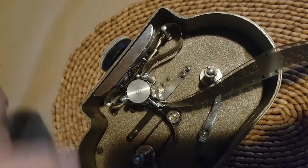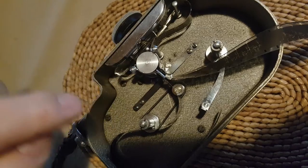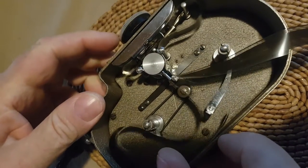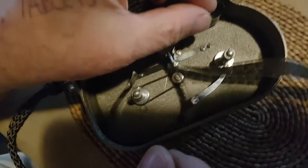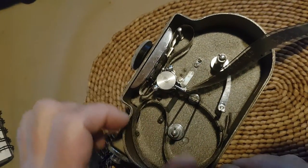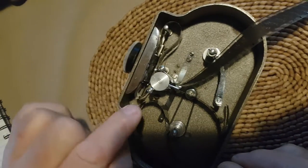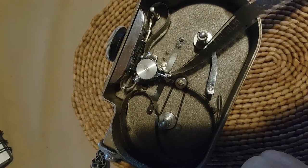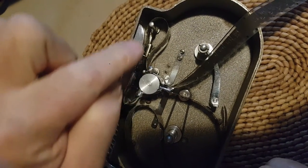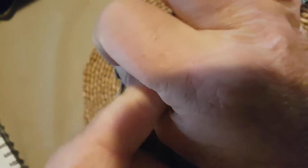Once it's stabilized itself, you can see that it's attached and being moved at all three points. If it wasn't, what you'd see is perhaps the top loop bulging out, or the bottom loop bulging out, or the top loop getting really small, or the bottom loop getting really small — like being eaten away. That's indicative that at one of these three points, the machine isn't holding the film in one of its perforations.